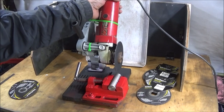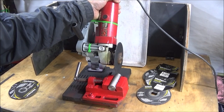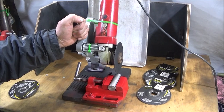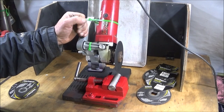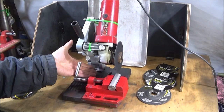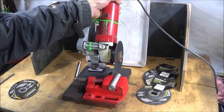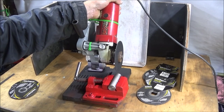When using it, I find it's best to hold the actual angle grinder and pull the disc down into the work rather than using the offset handle. When you pull down on the handle and it touches the work, there's a tendency for it to go over to one side — probably wear in the cut-off stand, which I'll sort out with new bushes sometime. If you hold the angle grinder directly and pull it down, you can get it to go dead straight with no problem at all.